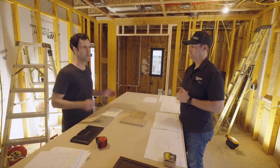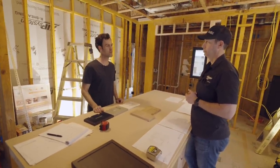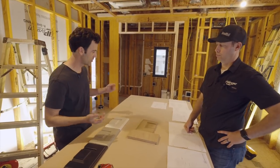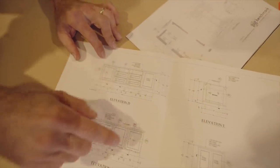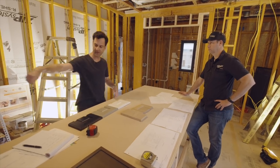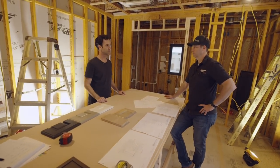It's going to take at least a day or more longer to install a kitchen with full inset because everything has to be perfect. On the island, we've got legs that run down to the floor to give a furniture detail — false panels on the end with furniture legs. When ordering, I order them a little bit long. When we come in, we shoot a laser, flip the island upside down, cut the legs off, and flip it so it sits level. You can set up the laser, measure down the side — say 36 and 7/8 on one side, 36 and 5/8 on the other — cut and trim the leg, and it fits right on the floor. Inset versus overlay: there's really no clear winner. It's your decision.